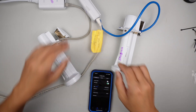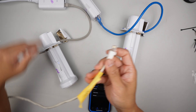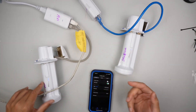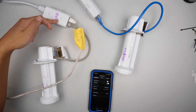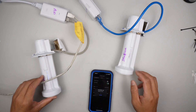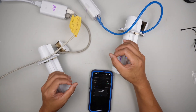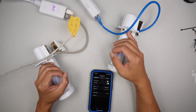The thing is already configured. What I've done is I need to unplug this cable and plug it back to the LAN, because my router from the internet provider is providing internet to the access point and powering the device. The access point will start shooting to the station. Now you can see the internet is plugged in and automatically all the lights start to show — all lights came on. That means we have a strong signal.